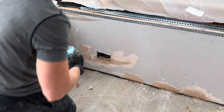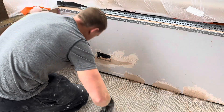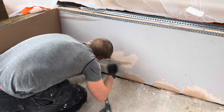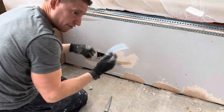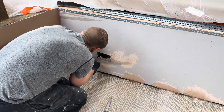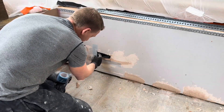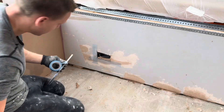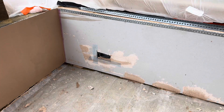So I'll get some scrim tape and line it up just right with the opening. When I plaster it, I'll make sure I put plaster right in behind that socket to fill the gap — you need to let that obviously tighten, but it's not a problem. And then two coats later, you've got this.